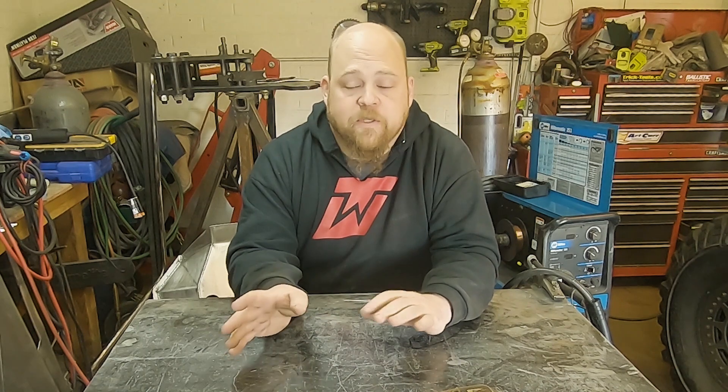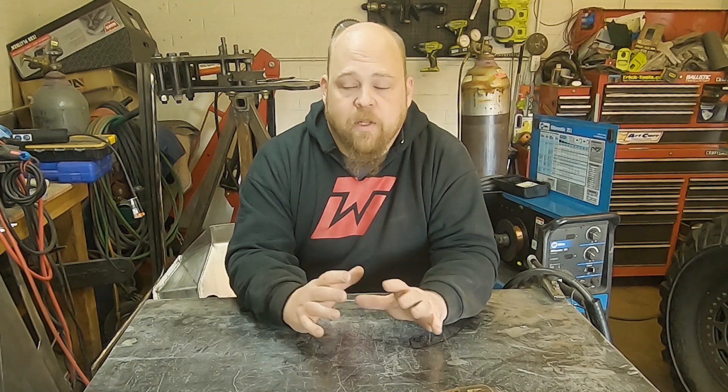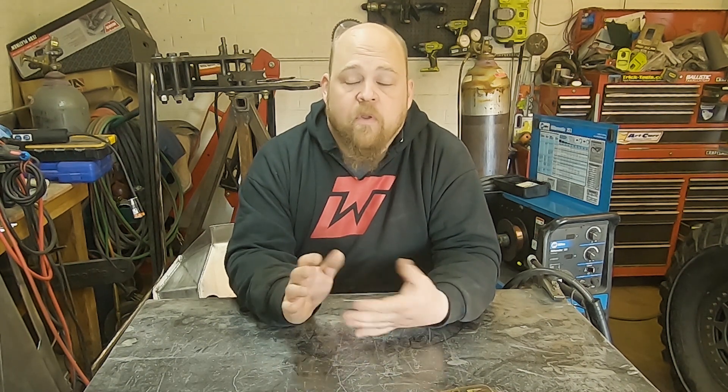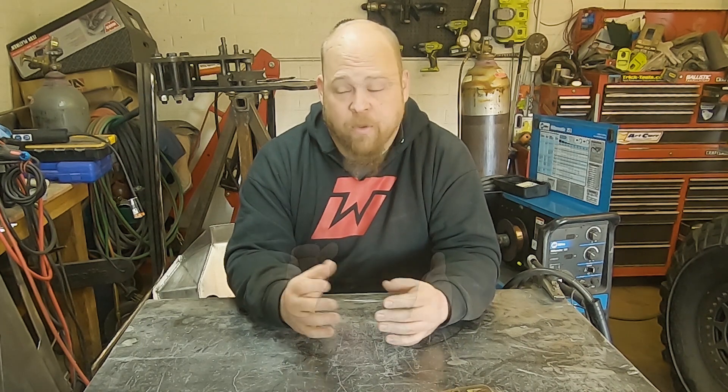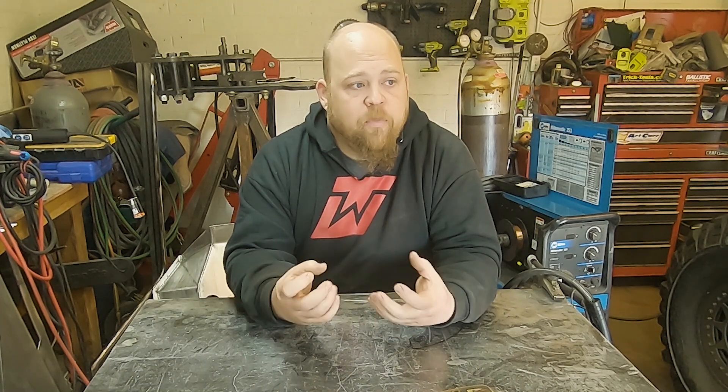There are lots of different wire types, but two you should know as a hobbyist welder are ER70S-2 and ER70S-6. The 'S' means solid wire; the number refers to the silica content. S-2 has less silica and is best for welding clean material without mill scale. S-6 has higher silica and is better for repair welding on material with rust, mill scale, or even paint — the higher silica brings contaminants to the surface, forming small brown silica islands.